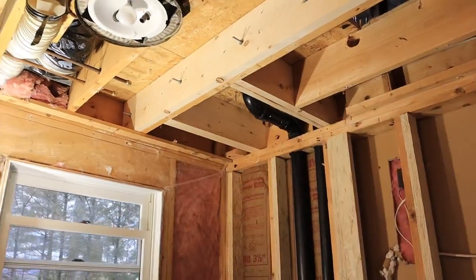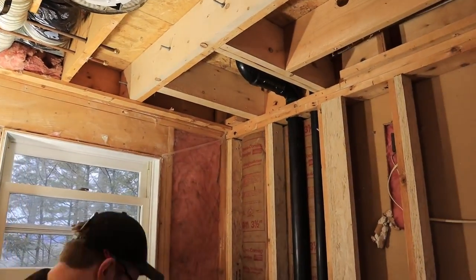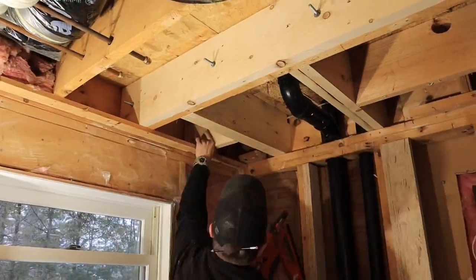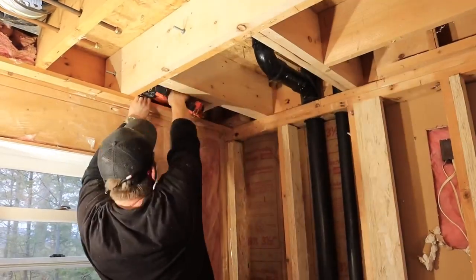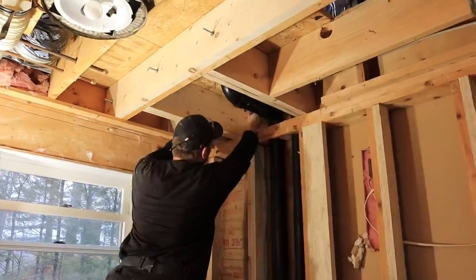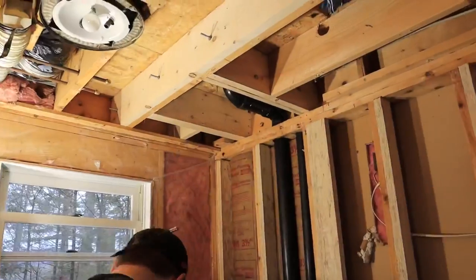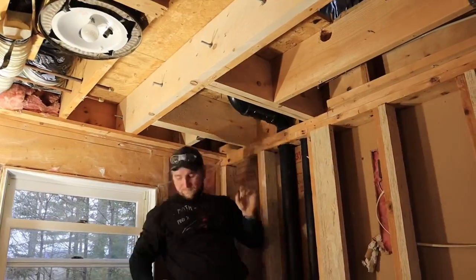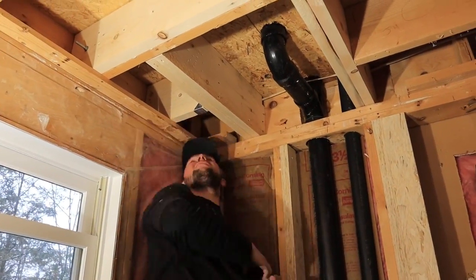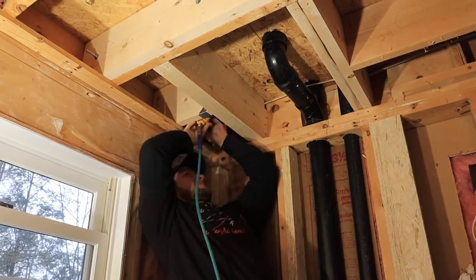This is called boxing it out — I boxed out the plumbing area. Laminating wasn't a good option here because I would have had to demo out the plumbing to get my wood in, and cutting a 3.5-inch hole in a 2x10 compromises the wood. Here I'm using a palm nailer — it's an awesome tool, really satisfying to use and great for getting into tight areas. Now I'm putting on the joist hangers: a single hanger on this side, same on the right side, and doubles get joist hangers too.